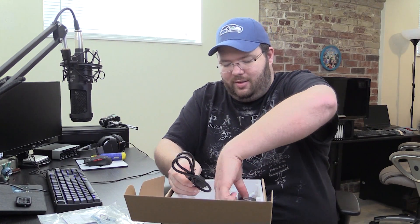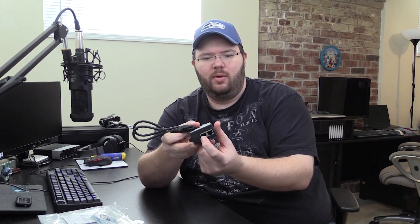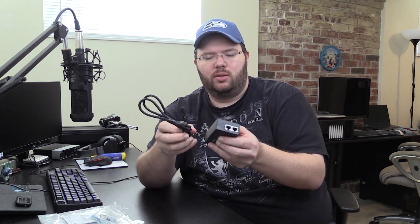The power setup is interesting: you don't plug this directly into a power outlet — it uses Power over Ethernet. The LAN goes in here, and the powered port comes out here. So you plug this into your switch, run directly into this port, and run your home-run cable to wherever it's going in the house off the powered port, giving you a dedicated powered channel just for this access point.